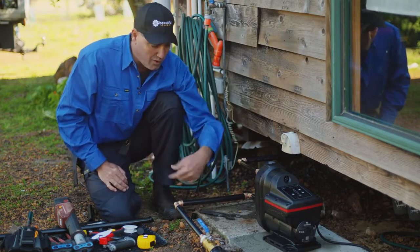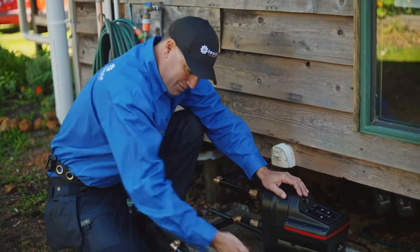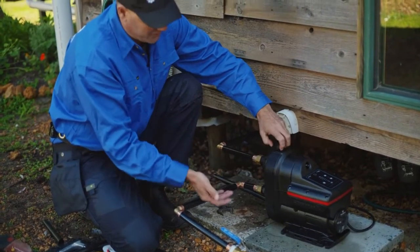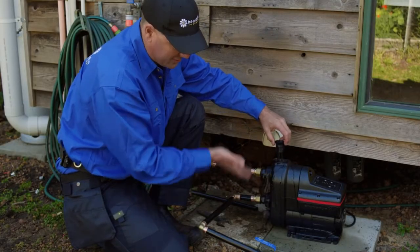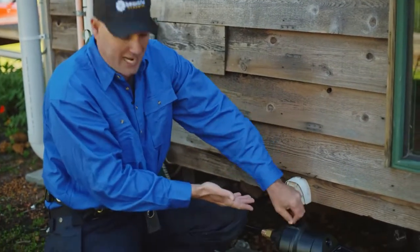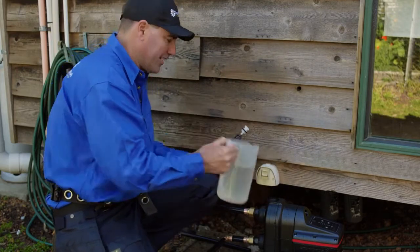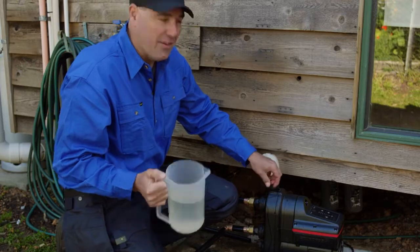The only thing we need to do now is prime it. If the water level is above the pump, make sure the rainwater can run through to the inlet of the pump. If you take the priming cap off and water starts coming out just from the pressure of the tank, you don't need to self-prime it — see how the water is coming out, so that's primed. If you're drawing from a water source that is below the pump, when you take the priming cap off, no water will come out. That's when you need to grab some priming water — about 1.7 to 2 litres — pour that in right to the top, then pop that back in and it's primed.